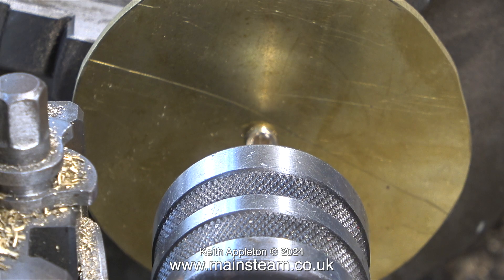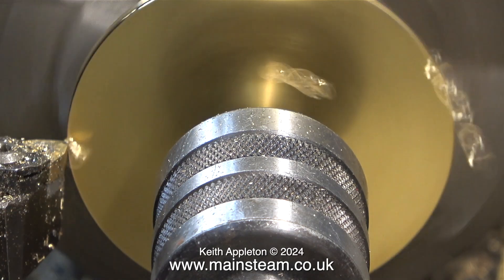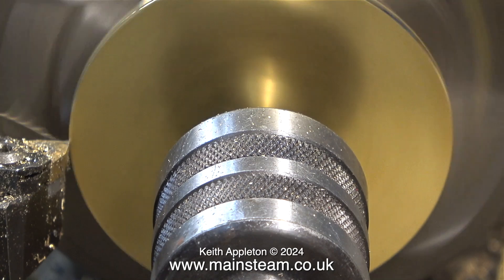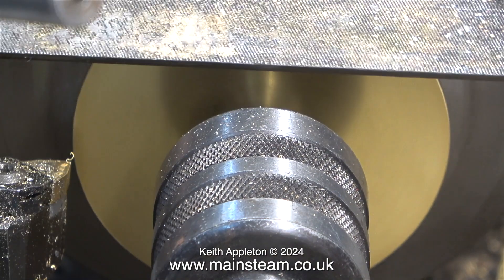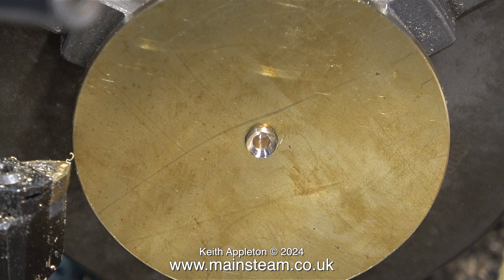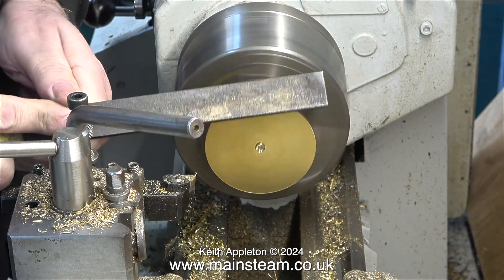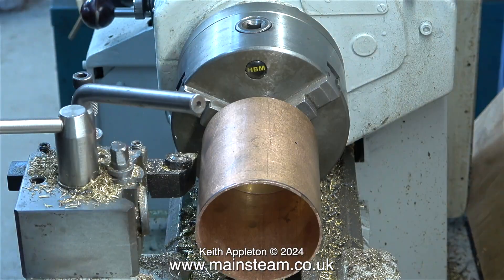As you can see in this clip the hole is not exactly in the centre of the piece of brass. To hold the part securely in place while I machine it I'm using a live centre. Although initially the part wandered about, it stopped doing that owing to the pressure of the cutting tool as I machined the edge. I cleaned up the edges using a file — not just to smooth it off, but to form a channel into which the solder could flow once it's fitted into the copper tube. I need this to be a strong joint, and the part is not a really tight push fit in the copper tube — this is intentional. It's a snug fit; it holds the copper tube in place without any support from me.